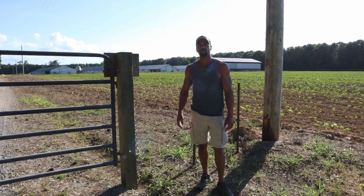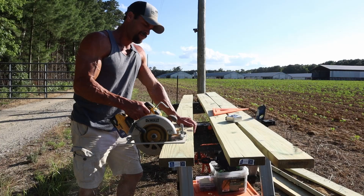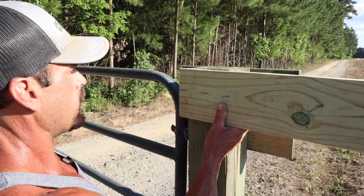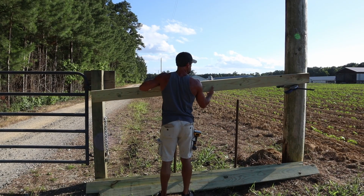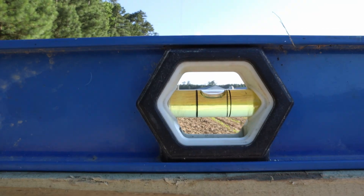You are going to need something nice to match your control unit and also the solar panel. So I'm going to match some 2x6s from this post to the light pole and we'll just cut those 2x6s to length with the DeWalt. No matter what I'm doing I like to look down my board and make sure the crown is up. I'm going to fasten this top board flush with my 6x6 post. I'm going to use this quick clamp to hold up one side while I secure the side to the 6x6. Then I'll come to this side and use my 4 foot level to get the board level.